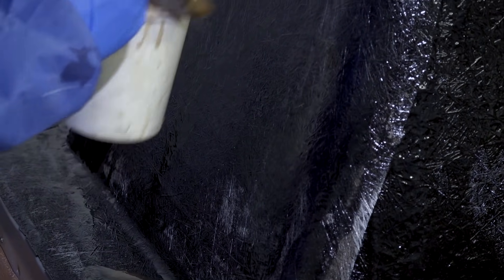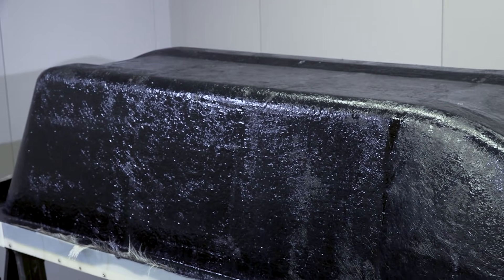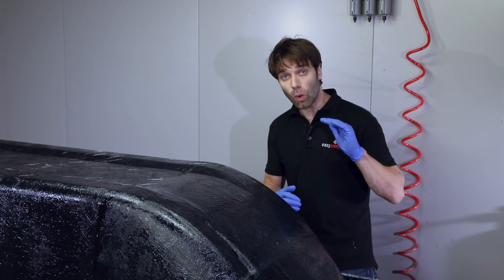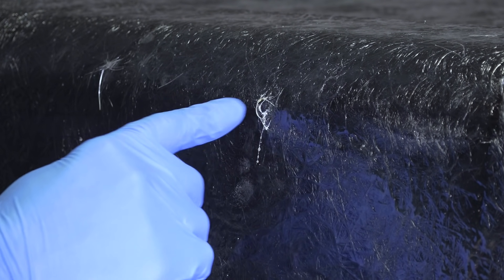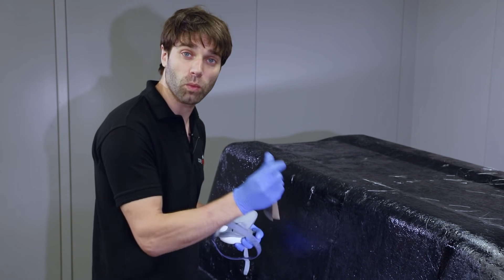The purpose of this coupling coat is to put a layer of reinforcement without any voids directly onto the gel coat. Unlike the tooling resin that follows later, the coupling coat resin is transparent, so identifying and eliminating small air pockets and voids is much easier. If in the following main tooling resin reinforcement there are small voids, these will be behind this coupling layer and therefore the gel coat will still be supported. With the coupling coat now cured to a tacky state, just prior to laminating you should inspect the mould for any areas of high fibres, as laminating straight over these is likely to cause an air pocket underneath. We're just going to rub these back with a bit of 120-grit paper.